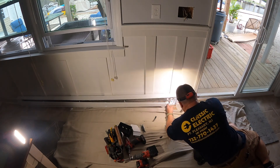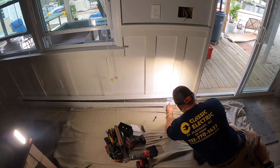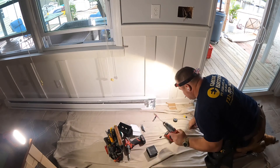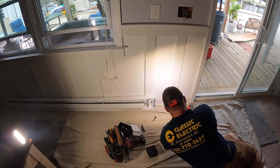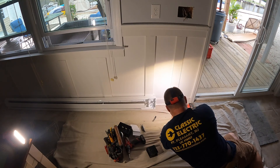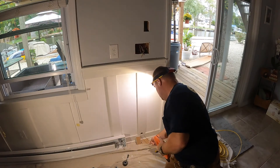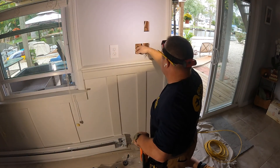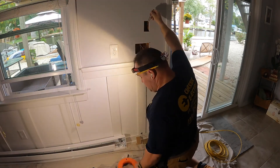We go ahead and install this 96 inch, 8 foot electric baseboard heater. I'm using the two pieces of sheetrock I just cut out as a spacer off the floor — there's some quarter round base molding that we left in place, and the two pieces of half inch sheetrock stacked on top of each other gave me enough room. Then I'll snake the wires up to the thermostat location and bring the wire down to connect to the back of the heater. This is a 240 volt heater, and the leads on either end are where the supply wires can be connected.